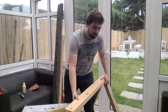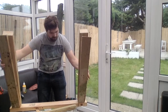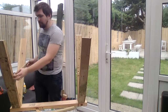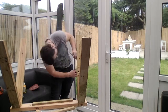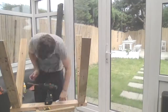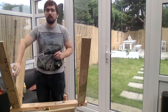What I am going to do is flip this upside down and mark where these need to sit on the legs. The next step is to mark and drill the holes for the dowels to fit in. To drill the holes I am using a 16mm drill bit to drill the holes in both lengths.